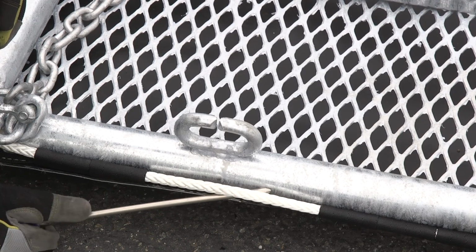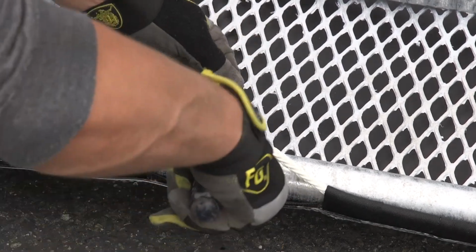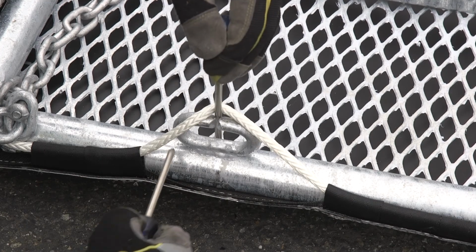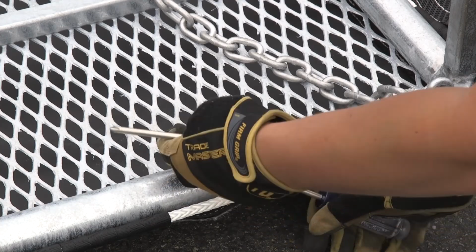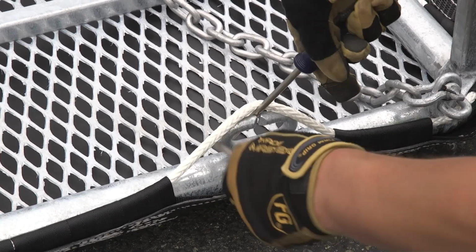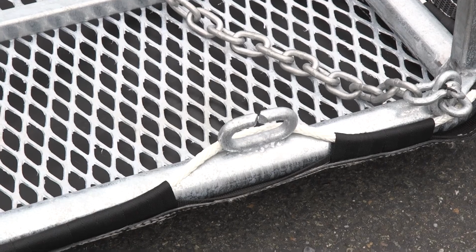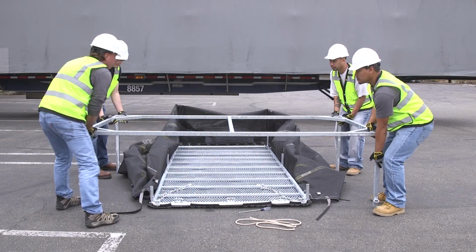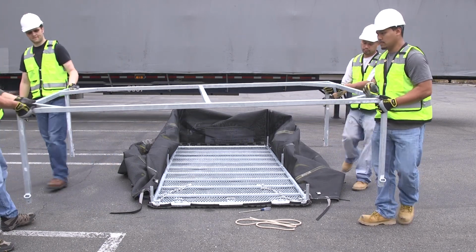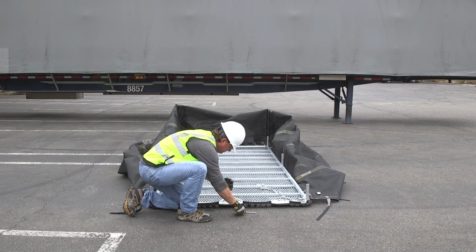To bring the securing line over the 2 outside C-links, slide the screwdriver shaft underneath the securing line and align it upwards with the slot in the C-link. Then raise the screwdriver upwards, sliding the securing line over the C-link using a second screwdriver for the sides if necessary. Release the bottom section from the top piece and remove it. At this time, bring the securing line over the center C-link.